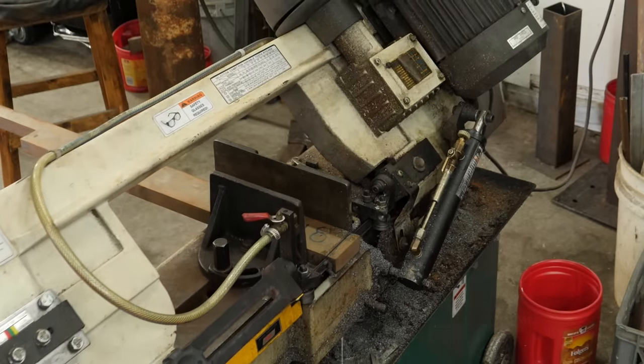Let's talk about some of the new things on this knife because it had many things I've never done before. I've never done this kind of composite twist pattern Damascus where you have twisted bars with interrupted twists going alternating directions. I've also never used the end grain of the carbon fiber on the sides of the handle — that's a brand new look. A big one for me was doing the 24-karat gold in the handle — that was something completely new and I had to do a lot of practice for that. The 2K finish on the carbon fiber handle was another big new thing, as was the black diamond in the pommel nut. I love this X-Cal fighter. May the forge be with you!